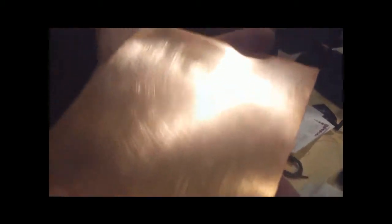I use a piece of steel wool. Very fine steel wool. That's why your boards fail. The steel wool, instead of abrasing, actually rubs down iron oxides onto the surface. I've tried that. Well, I hope that's a scientific explanation, but I didn't have a very good success ratio with steel wool. Alright. It mustn't be shiny. We get an idea of the surface. It must have little scratches, because when you do the toner transfer, it melts into the scratches and fills up and sticks nicely tight.